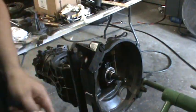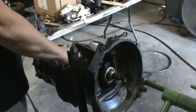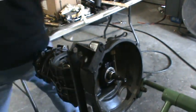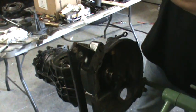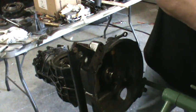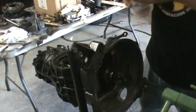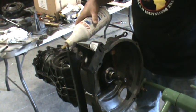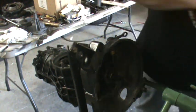I'll get out of your way — getting a little tranny grease here. I'm going to put a little bit of grease on the race there, and I'm going to give it a little shot of Lucas on the dish. Now we did tighten that pinion nut up — that could change the setup a little bit. So I'll have a good idea when I drop it down in there how it rocks, check the end play or the backlash. A little gear lube there on the pinion.